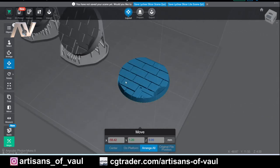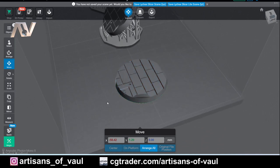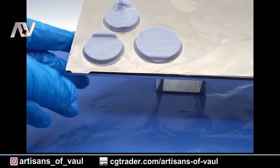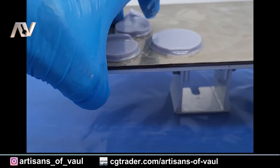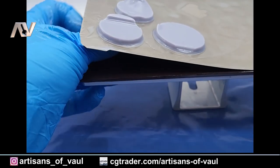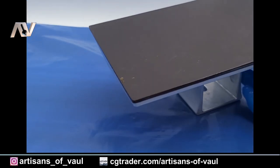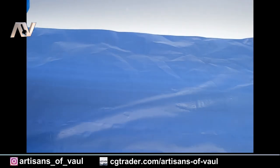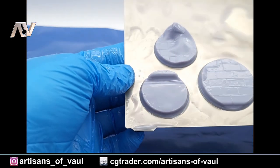This is just vastly quicker in printing time and there's less to worry about with supports. It's going to work great except for the fact that you then have to try and get it off the printer bed, and inevitably as you're doing this with a spatula you're going to chip it. That was until I bought one of these — I've got some bases printed on it. All this is is a metal sheet with a magnetic backing that you stick to your printer bed. You can peel this off really easily, and because it's quite thin metal it will flex, so you can just flex it to pop off the base and get a really nice smooth finish.